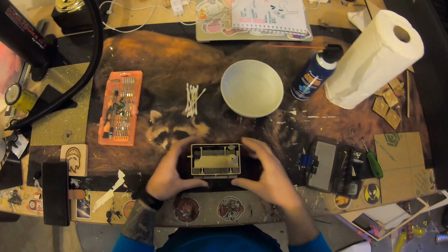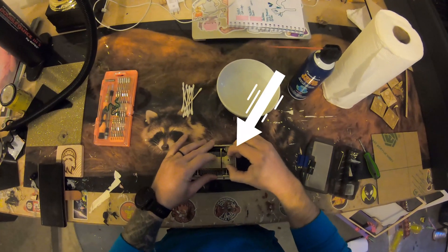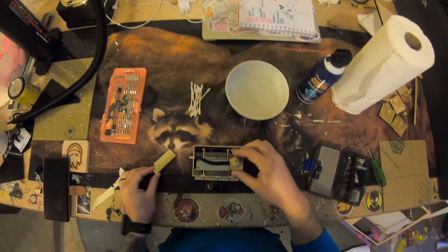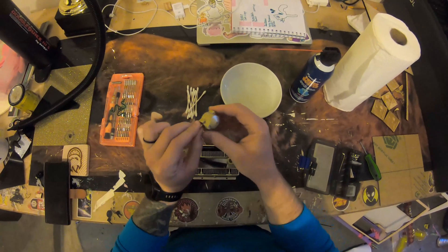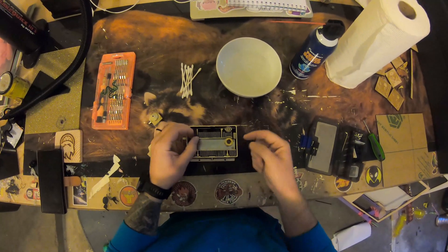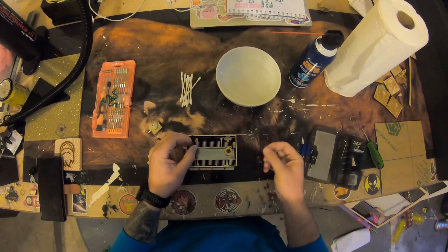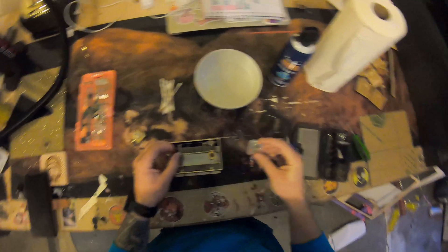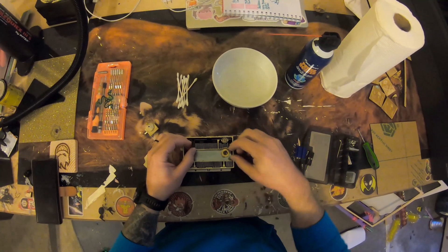I took the laser off. Now you have two pieces that you need to detach — this and this — and they both just pop right off. Mine's not going to be as dusty because I cleaned this not too long ago. So you have that and that. You have the hose here, you have your little plate. This is the lens protector, so this can be cleaned separately, or if you have an extra one, you can pull them out and swap them. If you want to clean this, dip it in alcohol and then go through that process.